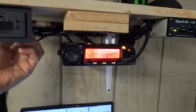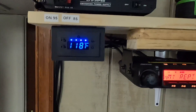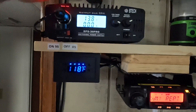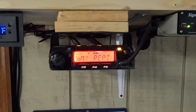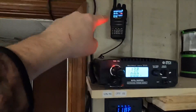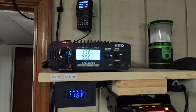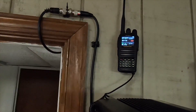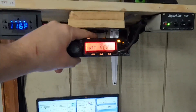If I wanted to, I could put that thing on a ham frequency and talk to the repeater up on the mountain and put it on Zello. I'm not going to do that because I know the repeater owner and he probably would not be excited about that. We're up to 118 now. I do have just a power supply up here for testing — I can pay attention to the amps. It only pulls like three amps on low power. I've got another radio that just sits up here that's really good for moderating the channel. And then I've just got a coax that runs outside. Probably shouldn't have as many barrel connectors in this setup as I do, but if anything gets burned up, it'll be this radio.